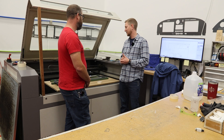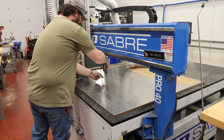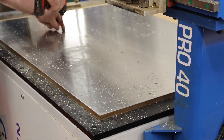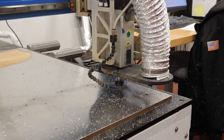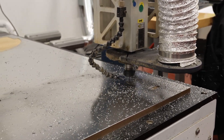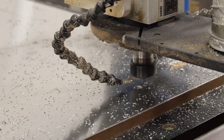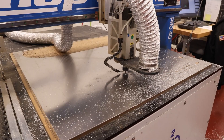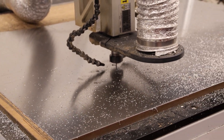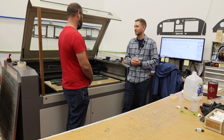Usually half a day is spent on lasering and graphics. And what about the CNC process, the actual cutting? Because you start with just a flat sheet of aluminum metal. How thick is that metal? We do 0.063 — 63 thousandths aluminum. It gets cut on our CNC machine, and then Blake here does all the fabrication on that — he adds in the rivets and the rails, and any sanding that needs to be done. All the fabrication is done over there, and then it gets shipped off to get painted.